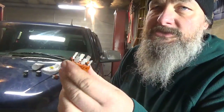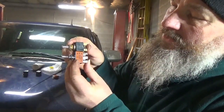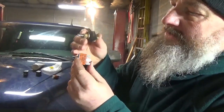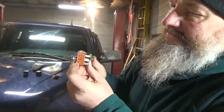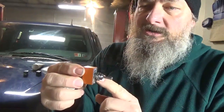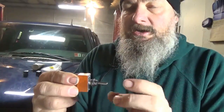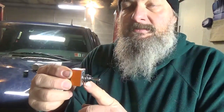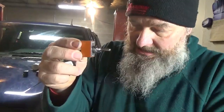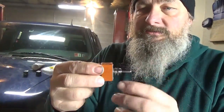This is the back of the old switch — you can see how your prong works — and here's the one on the new switch. Everything's pretty much the same. You can basically line them up, and you can see where it says 'on' on the new one. The old one is longer, but that doesn't matter — you can mount it up or down. The only thing that did matter was on the new one, it had a bigger collar back behind here. That collar wouldn't allow the switch to push through to get your threads out far enough to thread it on. So what I did — these have already been modified — I took that collar down with a Dremel, kept taking it down. Plus, since I'm going to use these, I made the holes where the switches mount on the plow a bit bigger, and they'll fit right in those holes with no problem.